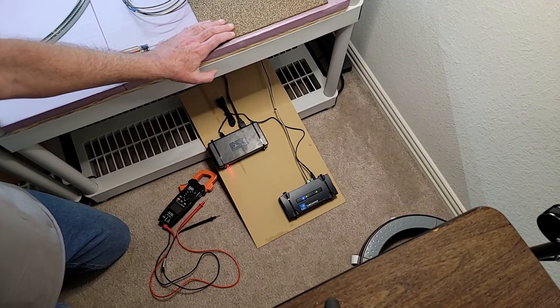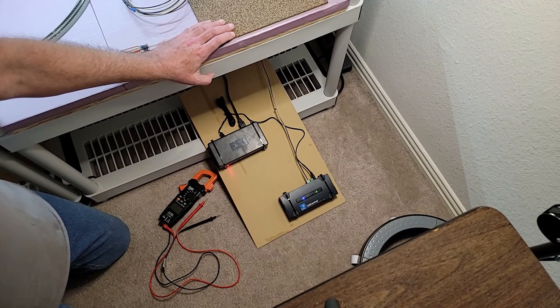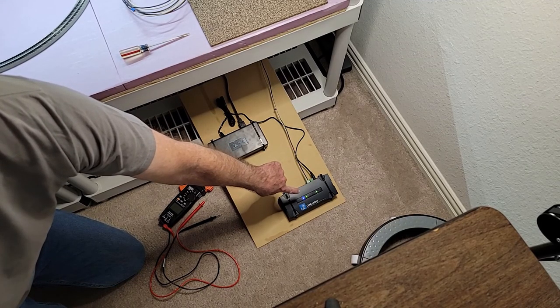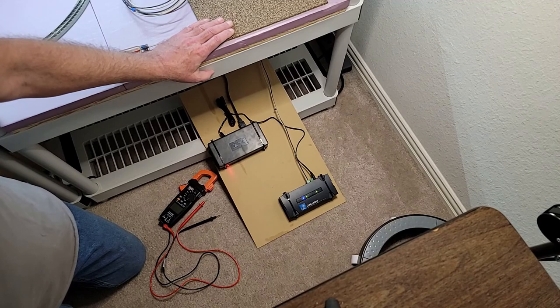All right, well, to answer my own statement slash question from a couple minutes ago, when I finished getting this all hooked up and getting the throttle powered up and connected, what I actually got was a big lot of nothing. If you can see it right now, there is a blue light shining. There's a solid green light over to the right side. And then over here, there's a flashing green light. So what I found out is slow flashing green light, the way it is right now, is a good thing.